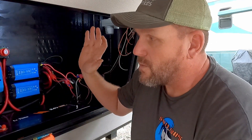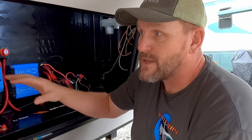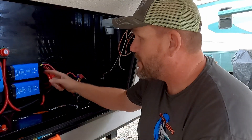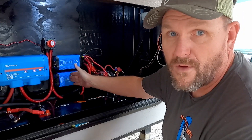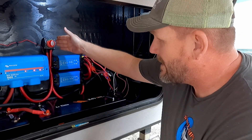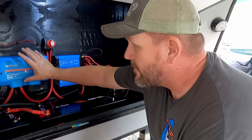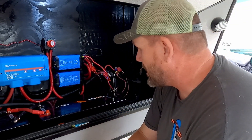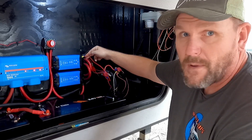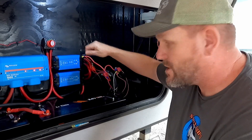What we're going to do first is flip the isolator switch over here and shut off power to our 12-volt system. We've got 24 volts coming in and 12 volts going out. Shutting this off will kill all the 12-volt systems inside the RV. I want to test these one at a time, so I'm going to pull the wires off to keep them separated — no longer in parallel — test them, and then adjust them.